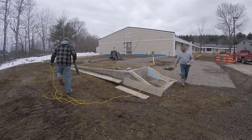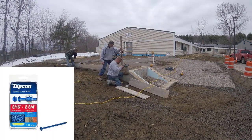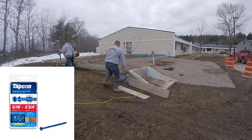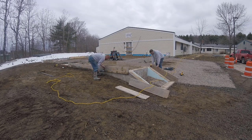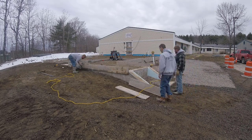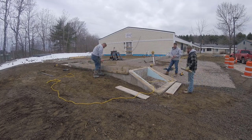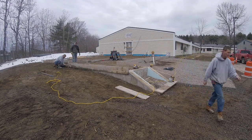We fasten these boards to the concrete using what's called a Tapcon screw — that's the screw right there. It's got a hex head on it and it screws right into the concrete, fastening the board really well. We use a nut driver bit on our DeWalt drill that goes right around that screw. My guy is using a hammer drill with a masonry bit to drill the holes, then he comes back and screws that board right to the wall and it holds it really tight.